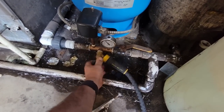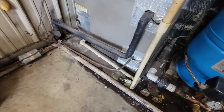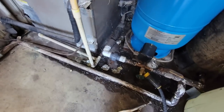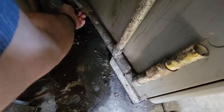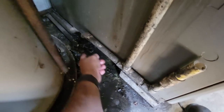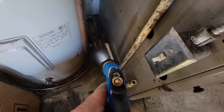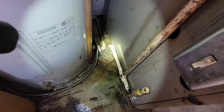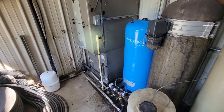I told them about what we did as far as taking off the plastic screen - it's there if they want to use it. That drain's not trapped - you can hear it. That's nice. It'd be hard to put a trap on it but still. Looks like I don't know how they had that hooked up. The other unit's draining out the side. We actually got a floor drain right underneath there - it throws all the slime. We just took the hose, blasted the crap out of it and it looks a lot better. They're just literally draining straight down into there. Went ahead and flushed the drain lines too.